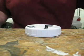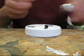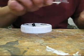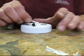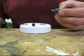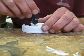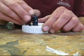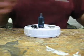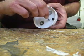Then I'm going to do the same thing with the one-way valve. There's a little bit more base to it. It's got an arrow that shows you which way is up. Slide that in there, smash it down. I'm going to do the same thing like I did on that 45 — go to the inside and put a little bit of glue around here.